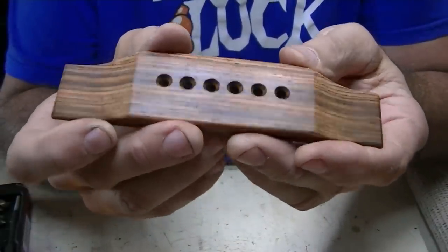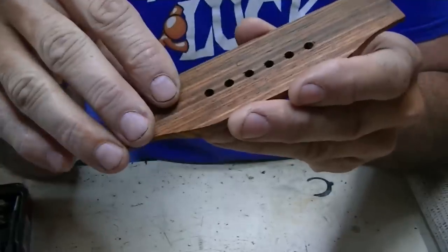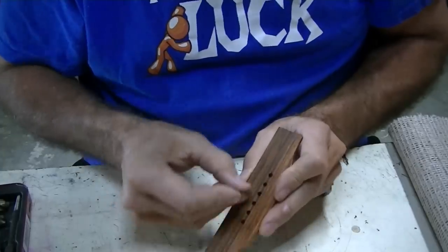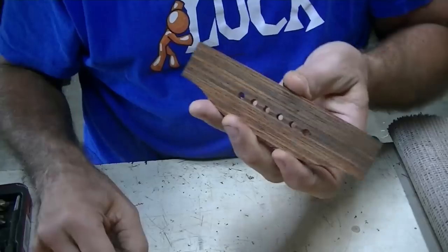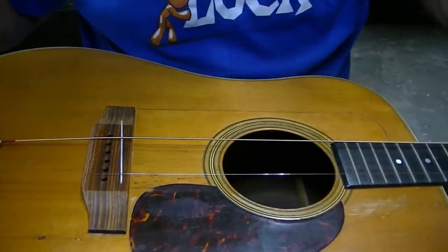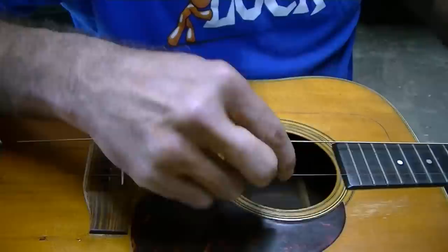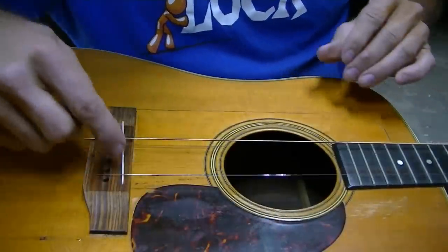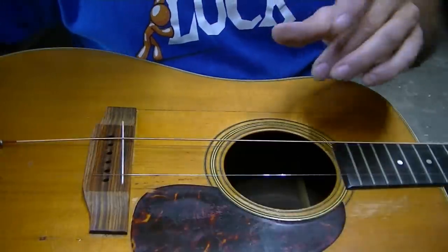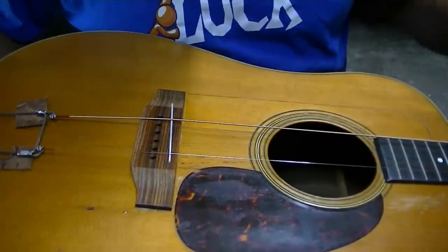We've made a good blank here. It turned out real nice — got it all beveled and rounded off around everything. The back was glass smooth and I cleaned it with acetone, then scratched it with this tooth blade. I've already done the scratching. Now I'm going to clean it one more time with acetone and then see how it fits up on the guitar top. Just as a sanity check, I put a temporary saddle under this new bridge and checked it — the intonation is really good. So we're going to have plenty of room to route a new slot in here.